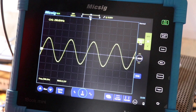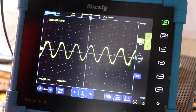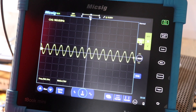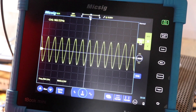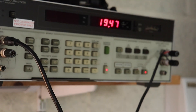At 200 Hz it's about 17 watts, but after about 300 to 400 Hz it's really starting to drop off. By the time you get to one kilohertz, we have to really increase the amplitude to get any half-decent power. Even then, if we look at the power output on the analyzer, it's showing 19.47 watts and I'm having to increase the input quite substantially to get that sort of output.